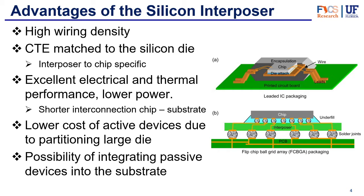This is due to shorter interconnections between the chip and the substrate. As you can see in the diagram to the right, for traditional packaging types the signal would have to go all the way through the lead and then through the wire bond into the chip. For devices that use the silicon interposer, it can go straight up and a little bit horizontally depending on what chip it needs to go to. But the distance is overall much smaller — you don't have any loose wires around, making it overall much more efficient. Shorter wires also mean less resistance and less losses, so it's more power efficient.